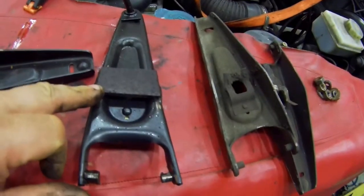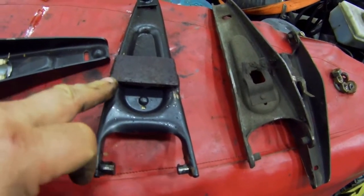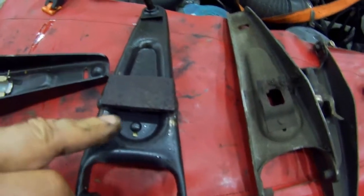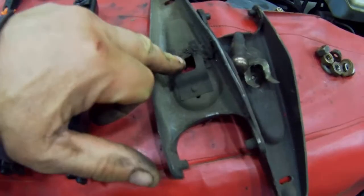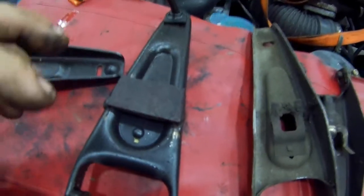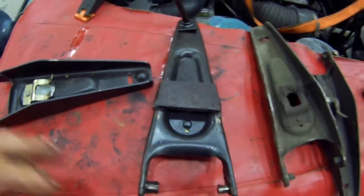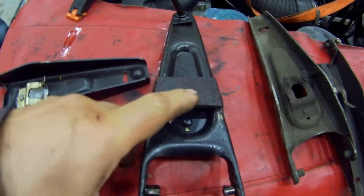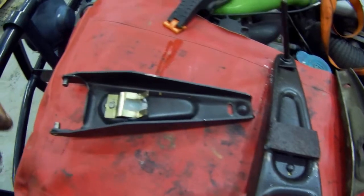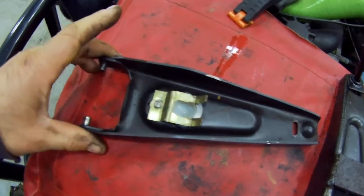We've done them for years and it's worked quite well. This has just come out of an HS2.8 with a clutch problem. But this is what we used to do — we used to weld a big thick piece of metal across here just to prolong the agony. What happens is when it wears through like this, it wears through the steel and you've got even more friction. The idea was that by the time it's worn through, it's time for a new clutch.